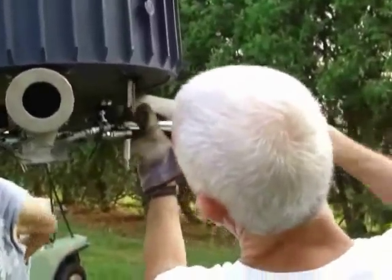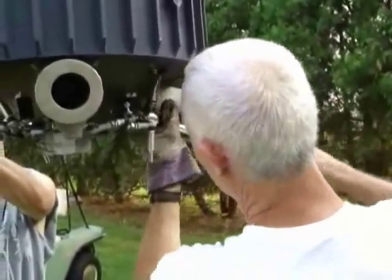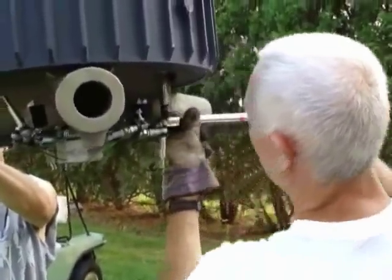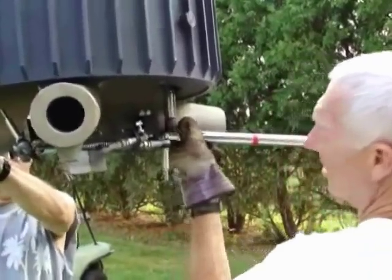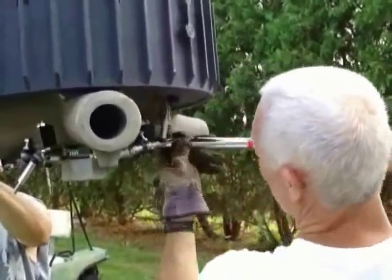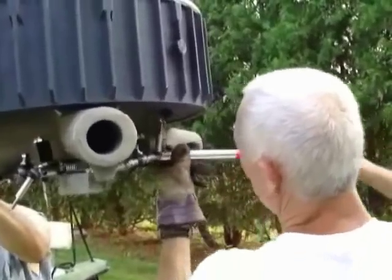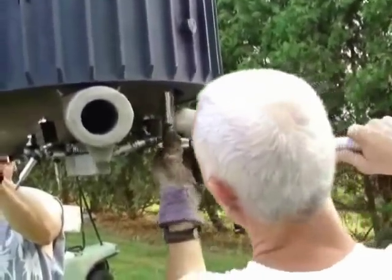That one pulled up quite a bit more after we got those other ones tightened up. The middle ones are at 30 foot-pounds but they're not even tight now after the outer ones were tightened. This is the last of the outer bolts, then I'm going to do the middle ones again and go back and check them all again — everything is finally seating in there on that magnet.